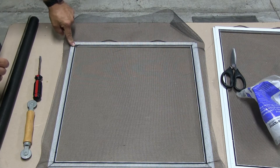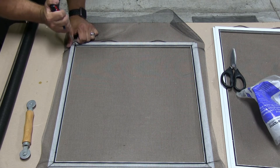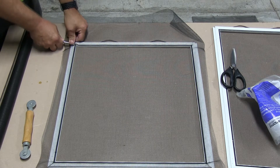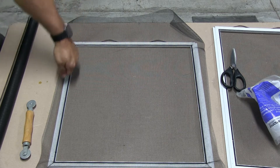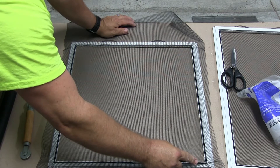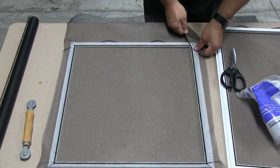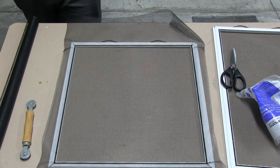We are just about done. You can see this corner came all the way out — you can stretch that; be careful not to grab the screen with your screwdriver. This screen is not aluminum, so it is a little more forgiving. Aluminum screens, when you try to do those, as soon as you make that first pass with the wheel, that is where the screen is going to stay bent — so if you follow up and that is it, you have to start over with a new piece. This stuff is some kind of fiber; I'm not sure exactly what it is made of.